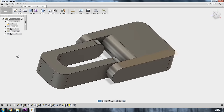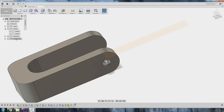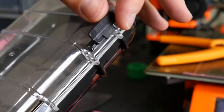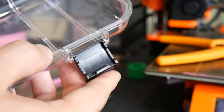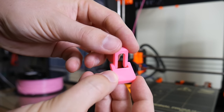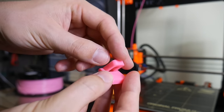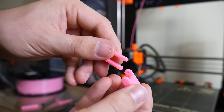The next kind of hinge has little bumps or nubs locking the two parts together. It's a variation on a pin hinge, but instead of having a pin all the way through, it has these little circular nubs that interlock together. You'll often see this kind of hinge in injection molded boxes where they use a stronger, stiffer plastic like acrylic. In injection molding, they have to snap them together afterwards, which means that you can print these hinges in place on your 3D printer. But if you design them carefully with a bit of room for the material to flex, they can snap apart. So you can design them in one piece to print in place, or you can design them to snap together. These are really handy because they print with no support, no issues, and you can easily make parts that snap together using this kind of design.